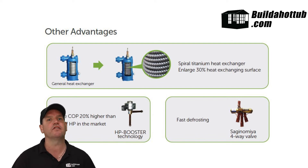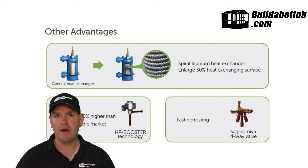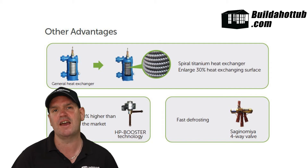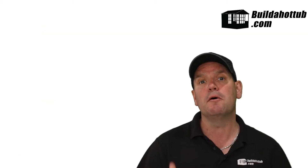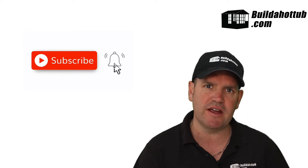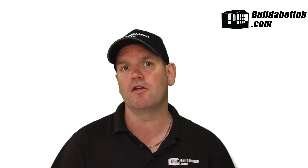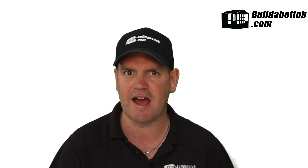It's particularly quiet and it goes into self-defrost mode as well. So anything down to zero degrees C or 32°F, it's actually able to defrost itself. The models are actually rated to zero degrees, and you'll see that some of the other models on the market will have lower ratings than that, so they can operate in colder temperatures. What this means is the Comfortline isn't just going to stop working at zero degrees — it means that it can't maintain the efficiencies that the manufacturer puts out in the specifications at temperatures below zero degrees C or 32°F.